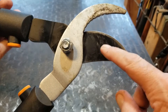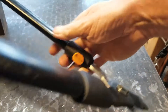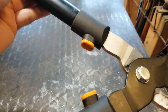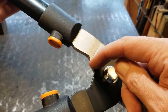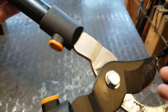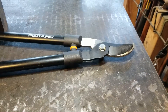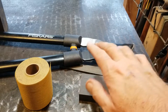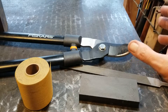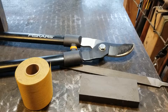You can see some drag marks back here on this side — I'll get rid of all of that. I'm going to take them apart. Over here on the silvery side, I had oiled these before I went out in the field and I should have brought some 3-in-1 oil with me, because the paint underneath this part was grinding off and getting between the two surfaces. These things were squeaking, squealing, and dragging pretty hard. I'm going to use some real basic tools — all by hand — sandpaper, a file, and a whetstone to get them up to stuff so they're easier to use and sharper. I really don't have any complaints about these at all; they're a really good tool and I'd still recommend buying them.